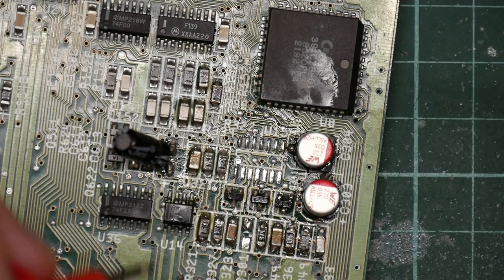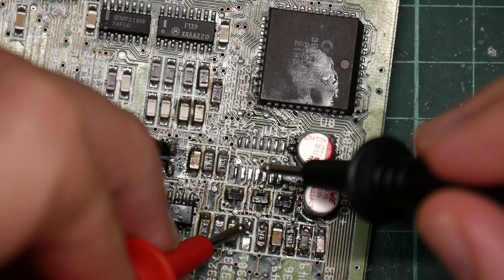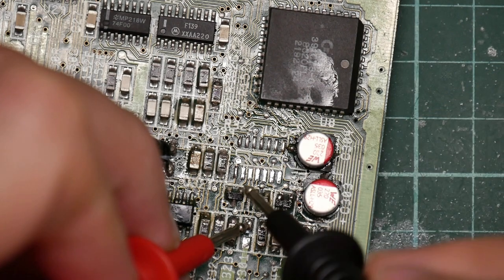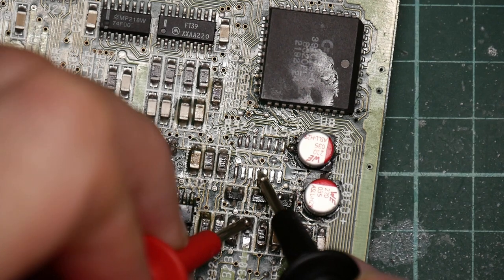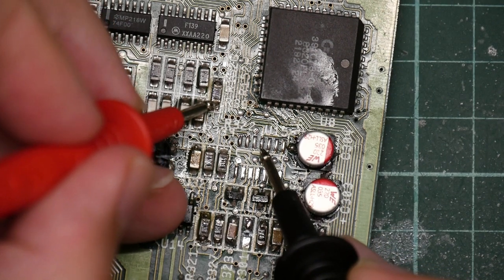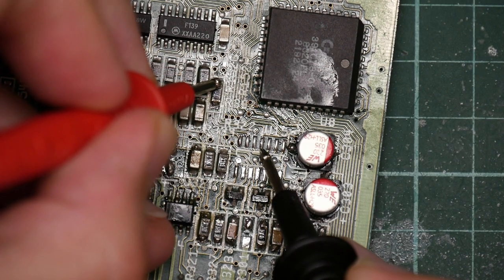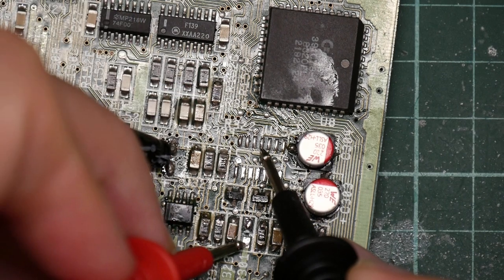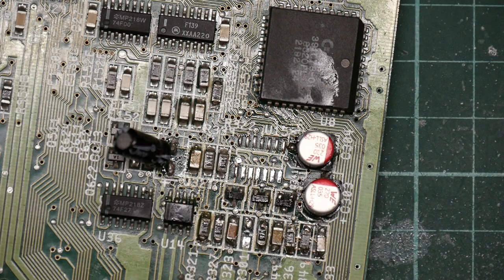So now that thing came off, which wasn't nearly as hard as I thought, let's check the continuity of those power rails. So that should be here. And the meter says 0.0 ohms. That's good. And now let's try this one. 0 ohms. And this end, 10 ohms. And this end, nothing. No connection. Excellent. So, as far as I know, that looks okay.